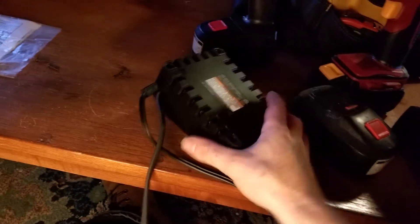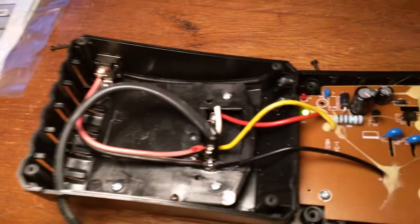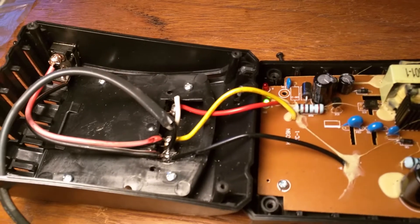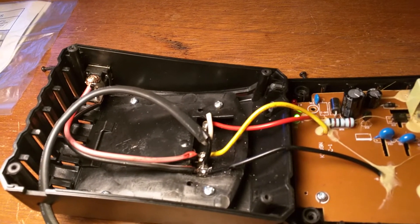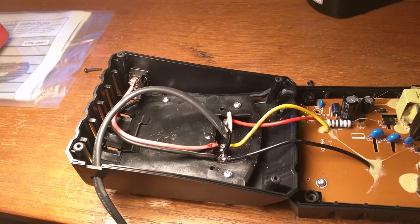So what are we going to do about that third terminal? I'll open this up and show you what's inside. I've done a previous video on this where I made an incorrect modification — I thought it would work but it didn't. What you need to do is jumper the middle pin, which is a thermal switch that comes from the battery pack, to ground. I've got it run to a switch — you could just bridge straight across with a wire. But I did it this way so that if I ever want to use the regular batteries with temperature sensing, I can switch it off. I put a switch through the side.